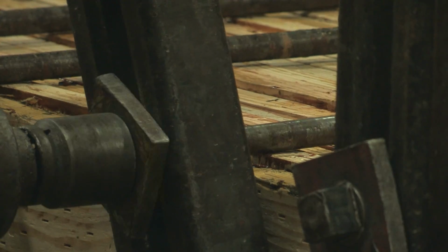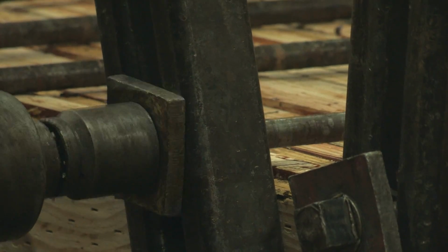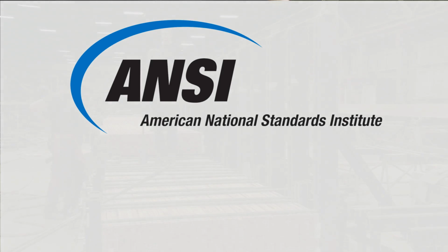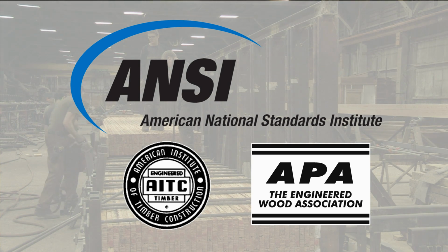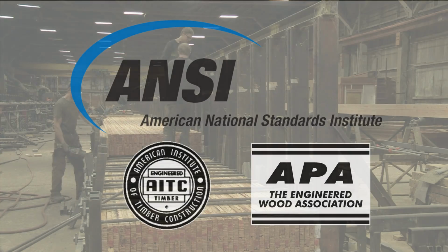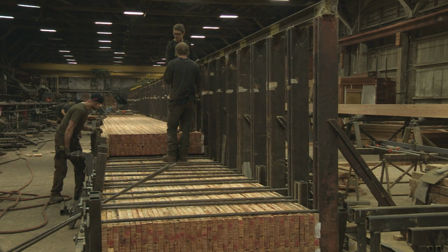The glued boards are clamped and allowed to cure for approximately 8 hours. All fabrication processes comply with ANSI standards, as well as the AITC or APA Engineered Wood Association standards. Quality control records are maintained by the laminating plant at all times, and samples from every gluing batch are tested daily for strength and glue performance. After curing, the clamps are removed and the pole is ready for finishing.